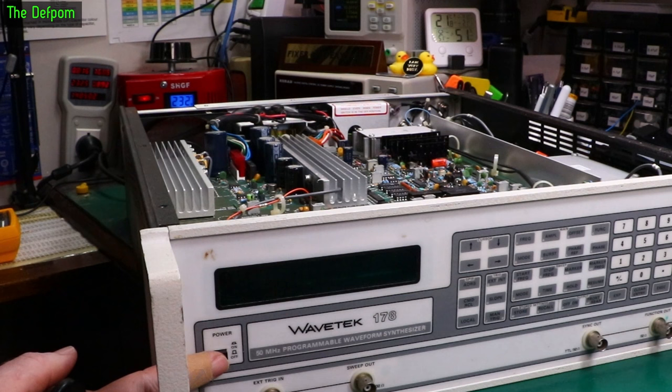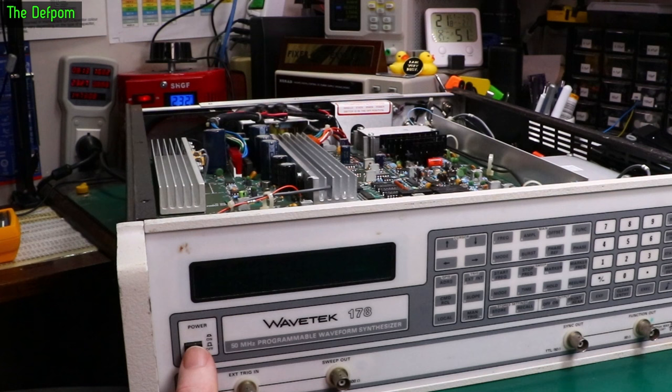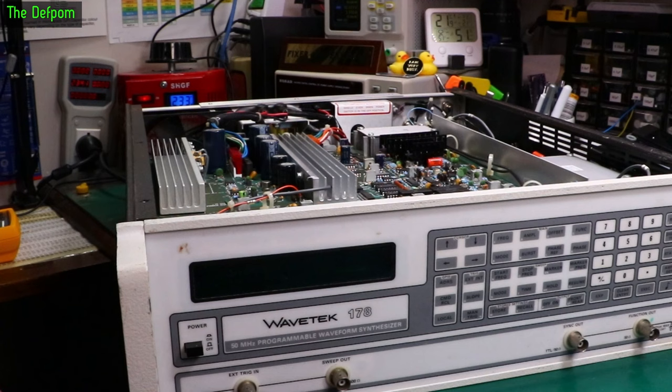Fan's going. It's drawing 170 watts, 0.8 amps. There is nothing coming from the display at all. It's drawing 0.8 amps and it's got a 1 amp fuse, so it's below its maximum rating, probably okay. But I think we'll need to check voltages — I need to find the test points for that. The display is dead. There could even be a shorted component somewhere loading down the 5 volt rail most likely. The 5 volt supply is right here — with that missing chip, does that mean it won't work because that chip is actually for display memory? I'm going to go find out.